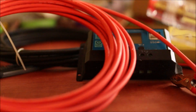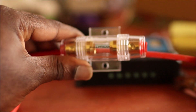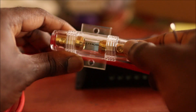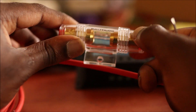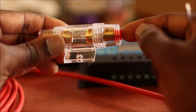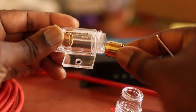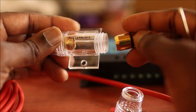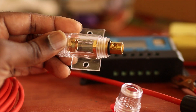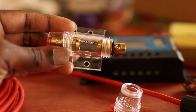When you have your cable, you will cut the cable inline. You can see the screws here. You want to insert the cable on both sides, and what we will be doing is putting the fuse inside, so that's how you can have a protected system. This is a bigger fuse holder but you can definitely do it.